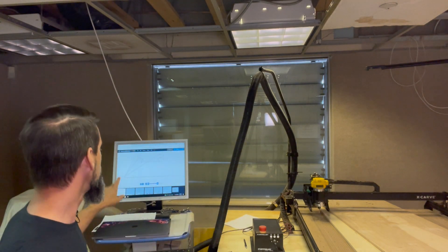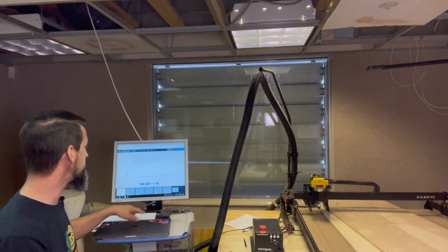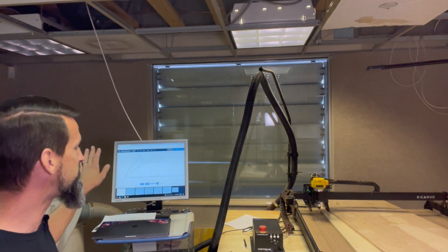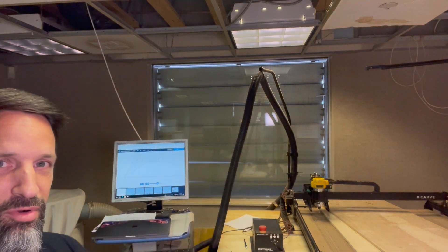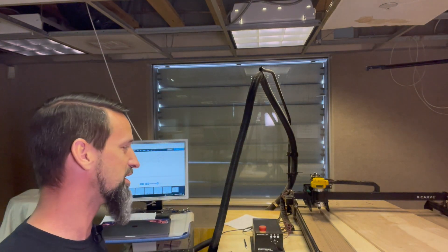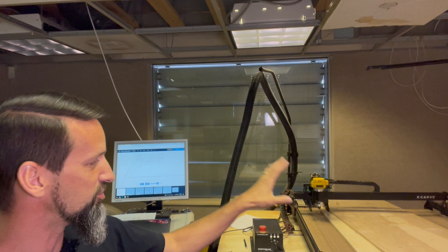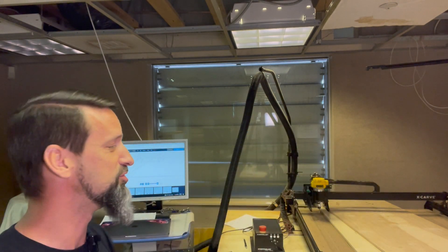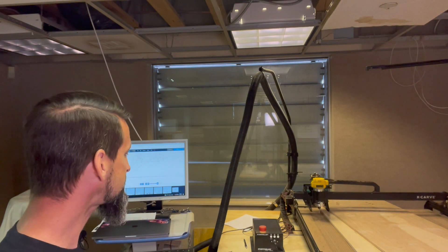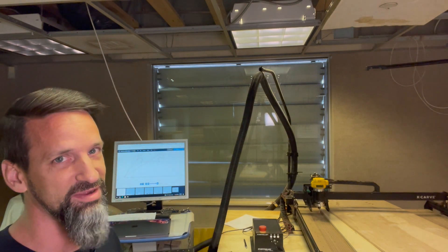You follow those instructions and load in the different files — I've got five of them. Five separate paths for the different types of cuts: pocket holes, bores, slots. I've also got a 3D pocket happening for the shooter lane. I think I've got a nice path for the shooter lane, but that's the one I'm still tweaking. Everything else should be set up.